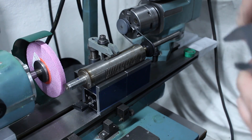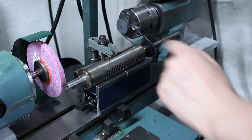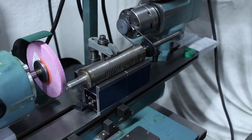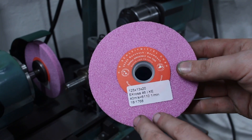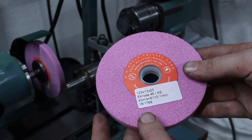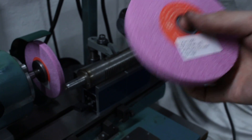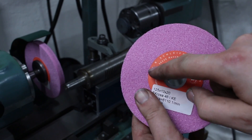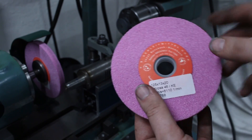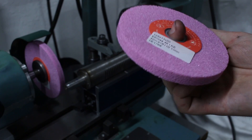Getting the indicator and sine bar out of the way, and marking off the length to grind. The overall length is not critical at all — it just needs the right diameter and the right taper. As for the wheel: it's a 46-grit aluminum oxide wheel. I have these made especially for my grinders because you normally can't get surface grinder wheels that small. I got them from HB Schleifmittel GmbH here in Germany — very reasonable, about 14 euros apiece.